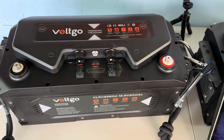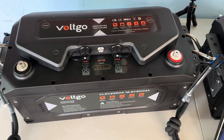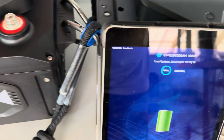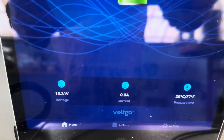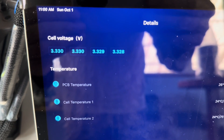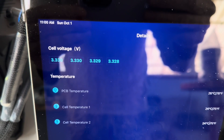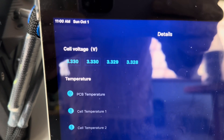Okay, it's the next morning, about 12 hours later than the last shot, so we've got 108 hours on this being on all the time. It's just not drawing down very much, which is great — 99 percent full still. Battery voltage 13.31. Let's look at the cells: 3.33, basically straight across, with just a tiny fluctuation on the last two cells, but we can call that pretty much 3.33 straight across. Looks really good.